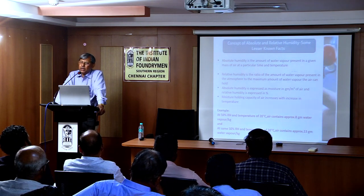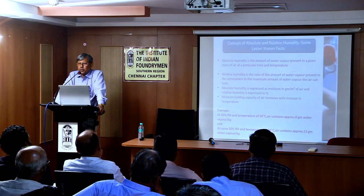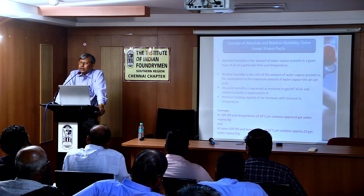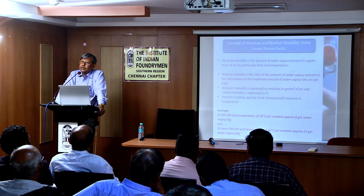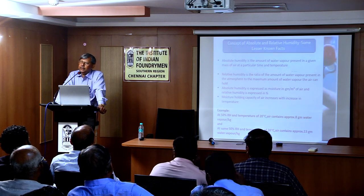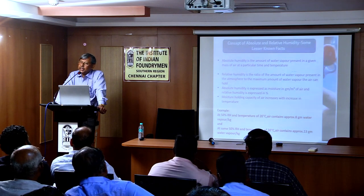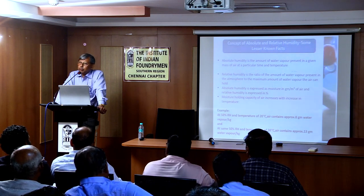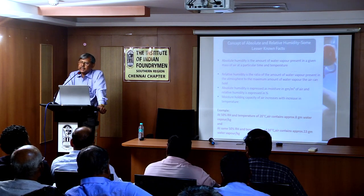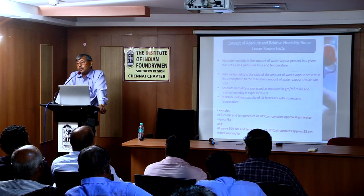I think only one or two that I know. It was Tata Motors Pune, but that foundry is closed. Now it is KFIL. For all binder systems, moisture is the enemy. But in the cold box system, it is something more. Why? Because in other systems, moisture is adsorbed in the system physically. Here the binder reacts with the moisture and is spoiled.